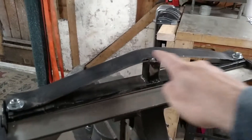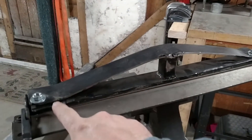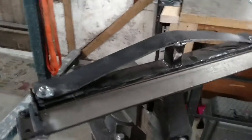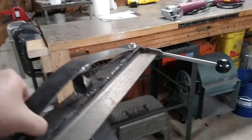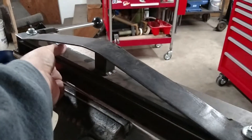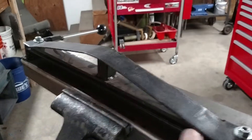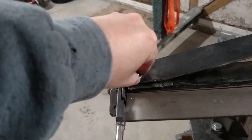The second thing I did: when you buy it, it does not come with this bridge and this piece of square tubing right here. You only get this plate, and what they want you to do is put your sheet metal in through here, in between these two. Then you come around here and use C-clamps, vise grips, or whatever you can to clamp it, and then bend it up.